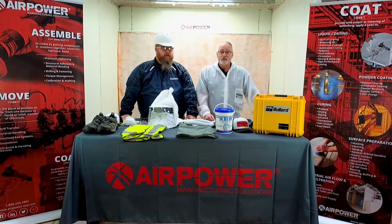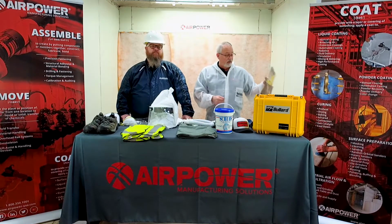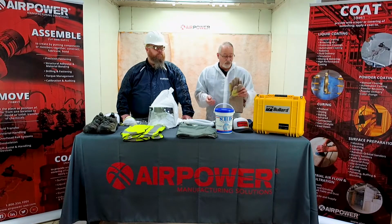Ovens, so when you go to take your powder coated parts, push them in and out of ovens, or grab one out of an oven, or push a rack in, pull a rack out, high temp gloves are used to protect your hands there. These are typically good for about 450 or so, which is about the top of the temperature range that you would be curing your parts at for powder coating anyway. So protecting your hands there.